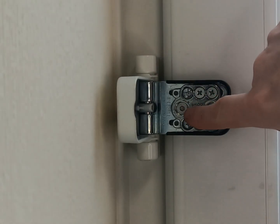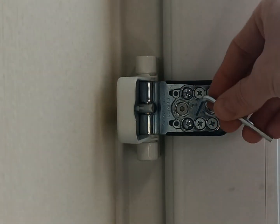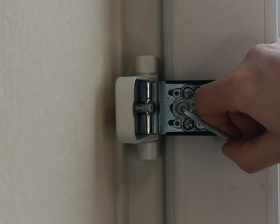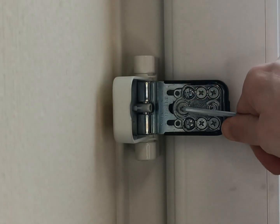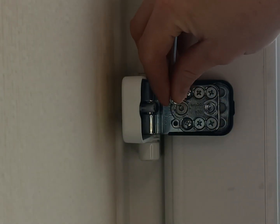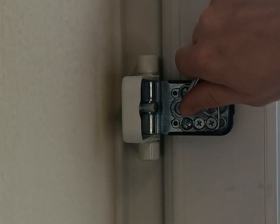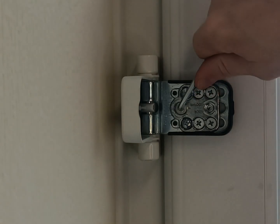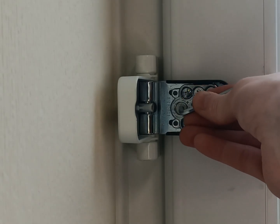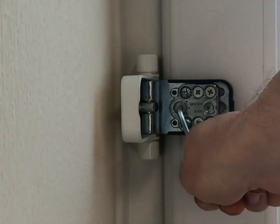And now you go over to the opposite side where you've got your adjustment with plus and minus. So if you look at the actual hinge move as I do this, you can see the door spreading, or you can pull the hinge in closer. You get a good amount of adjustment with these hinges, so you get 5 or 6 mil in them. You see that spreading further apart and how close you can pull it in as well.